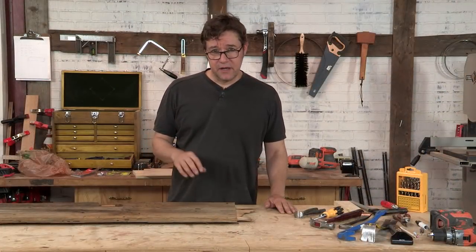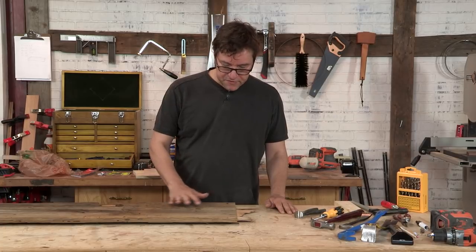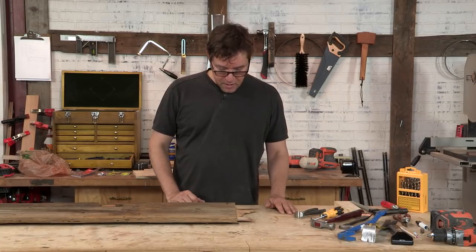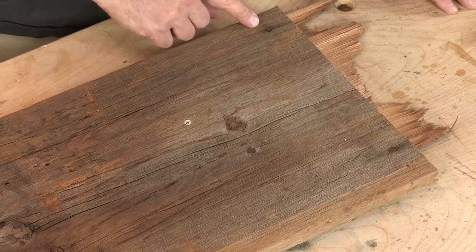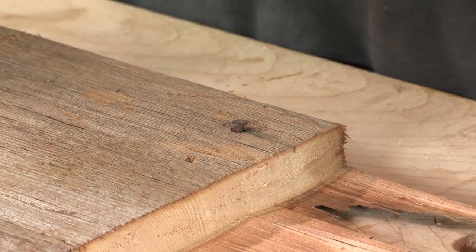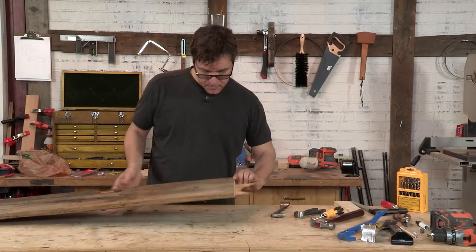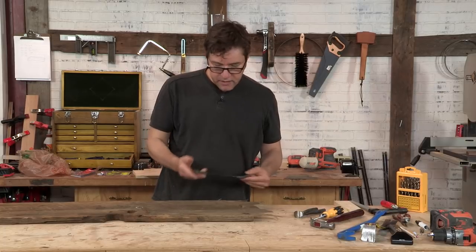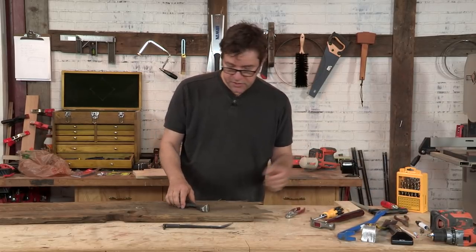After we've identified the nails, fasteners, and screws and marked them, we're ready to extract them. If the surface of the wood is very important to us in order to preserve its patina, we want to make sure that we harm it the least. The first thing I do is try to extract the easiest fasteners first. In this case we see a nail whose head protrudes above the surface. It might look like an easy job, but sometimes the nail is actually bent on the other side. So what I try to do is flip the board to the other side and straighten the nail as much as I can. I'll take a pry bar or a cat paw tool — or you can also use a nipper or a pair of pliers. These are all legitimate tools to straighten the nail.